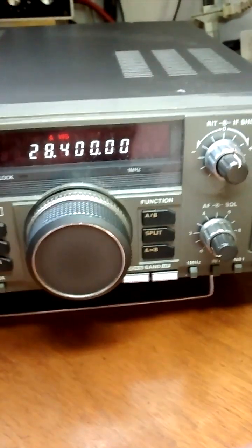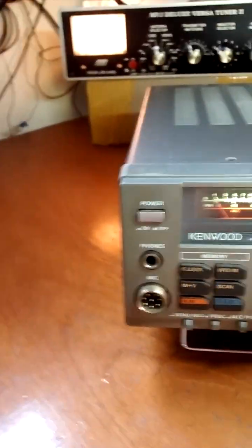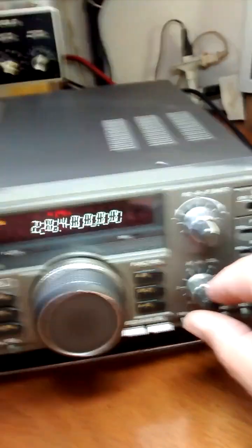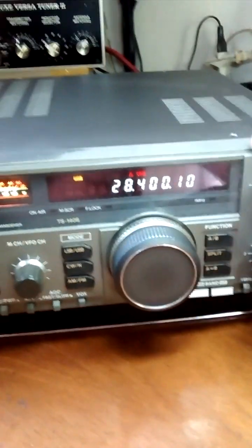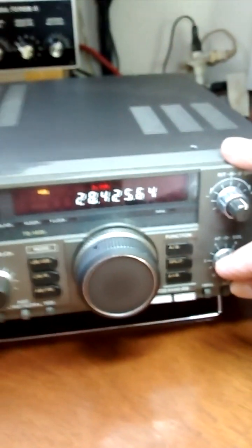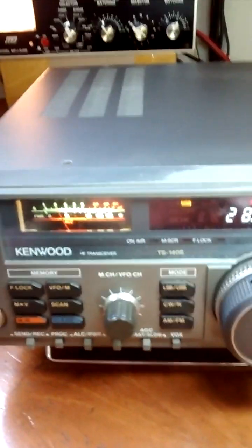It's very good equipment. The receiver conditions are about like the TS-940, so it's really a good receiver for DX. The receiver condition is not good because the potentiometers are failing, and it has no signals. But when I try to transmit, the signals come on. I hope the problem is the relays — the filter unit relays and LPF circuit relays.